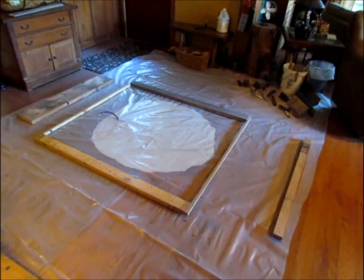I have made a screeding frame. I don't want this pad to have square edges, so that's why it's out beyond the pattern on the floor and paper. But this will give us a 1.5 inch surface to screed off from once we get concrete started.